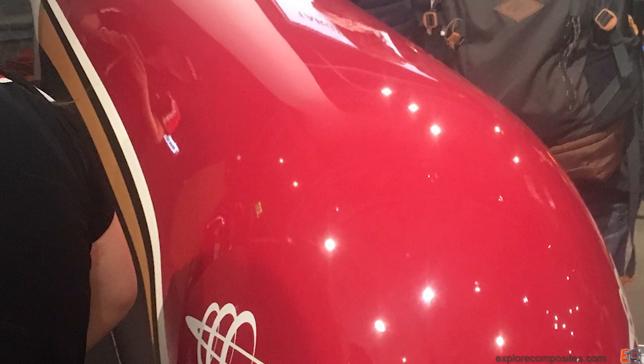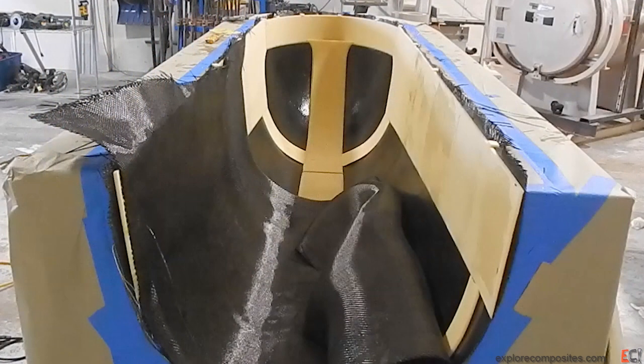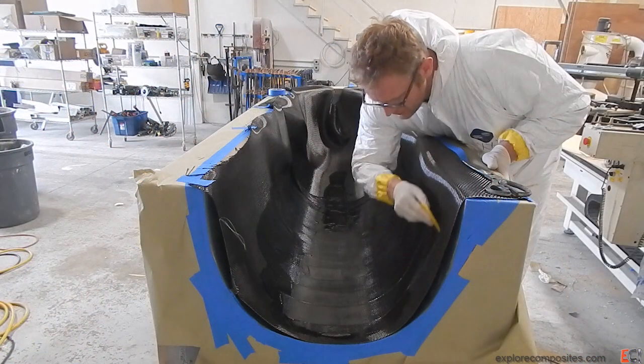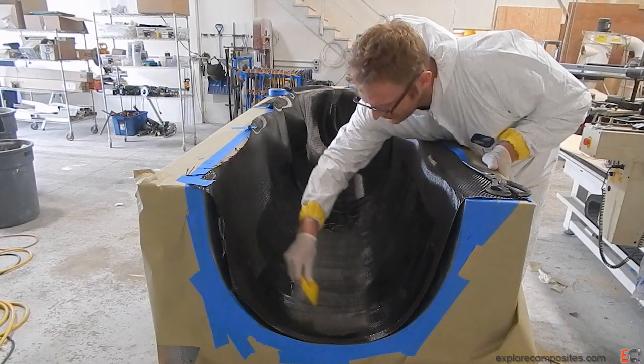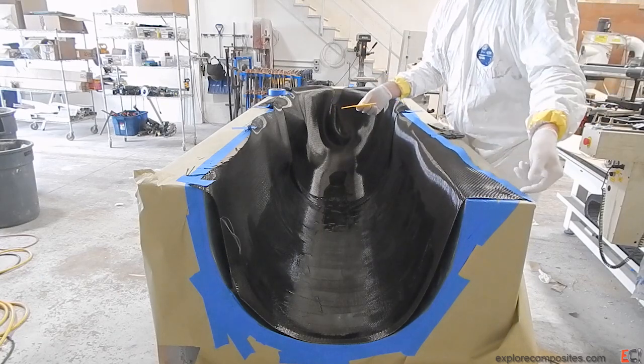I know that included a couple of shots of primer and a lot of nice blocking, but the way I delivered it to them, it was fair and smooth but certainly not ready for top coat. The distortion in the glass from having been done in one shot was not ideal. If it had been skin in one cure, then core, then the inner skin, it would have had a lot better continuity to the fiber in the outside skin, and you would not have had all that ugly wrinkling or warping. I'm not sure structurally, given the demands on this, whether it would have made a difference, but it would have looked nicer. And if we had been, as originally planned, doing this as a clear finished part, then I certainly would have done that.